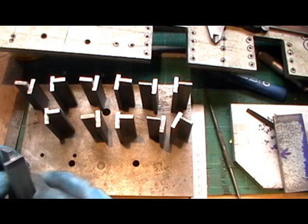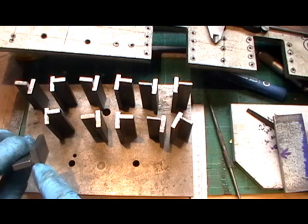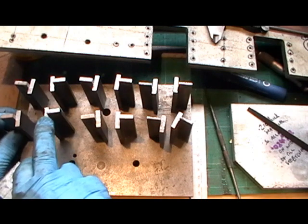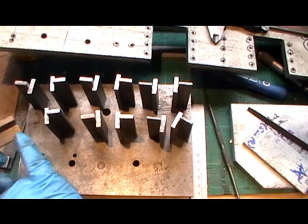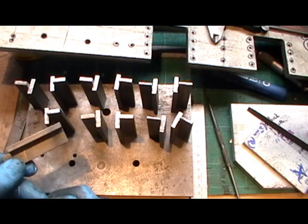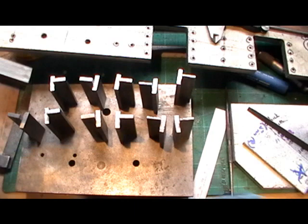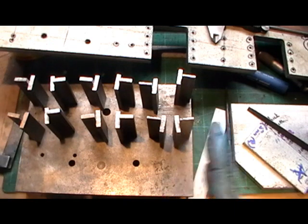Progress report. I've now got my notches cut in my horn guides. My horn guides are complete except for one thing - I've got to drill and tap a hole to accept the keeper plate. It's five sixteenths by five sixteenths steel which will bridge across the horn openings. Just to recap - I've numbered them all up for the left hand side, kept them in pairs: L1 for the first slot side from the front, and R1, and so on, so that they're kept in pairs.